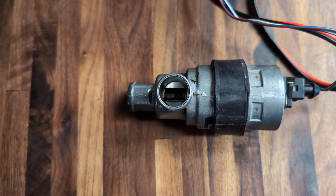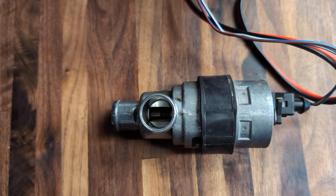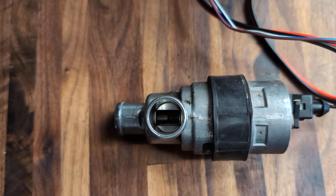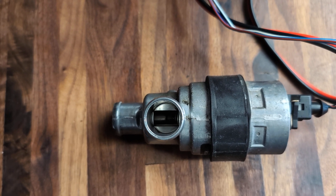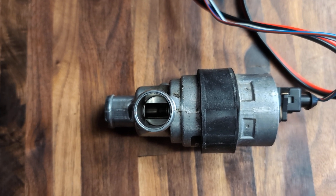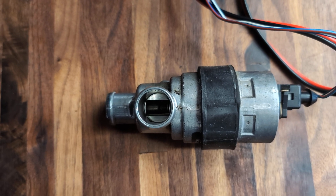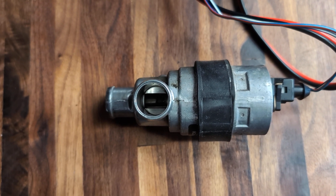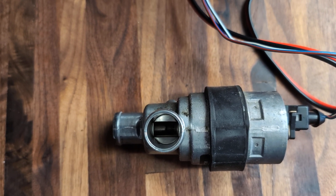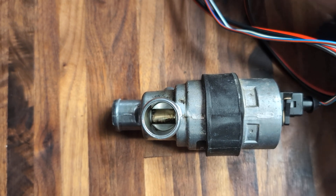One important final note: running this at 75% PWM on 12 volts — approximately 9 volts to the coil — this valve is fully open. This is one of the reasons you do not want to plug a 12-volt battery directly into one of these idle control valves. With 12 volts applied directly, you could burn out the coil if it sat there long enough. If you just touch it quickly and it snaps open and closed, all you know is that it can move to its extremes. What you really want to see is smooth, controlled movement to confirm it will properly control idle.